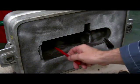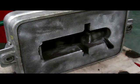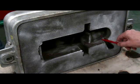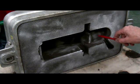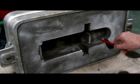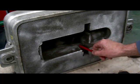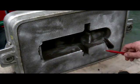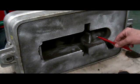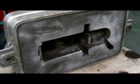If you have a look here, here's the void or the hole in the sand. Molten material will come in from one half of the flask, come down through what's called a sprue. We have a little turbulence in here for the molten material and any foreign material to get caught. Then it comes in through the runners and through a gate right here and into the casting. The other half of the box will be on top so this will be totally enclosed, and the material will sit here until it solidifies. Then we'll break the sand apart to expose the casting.